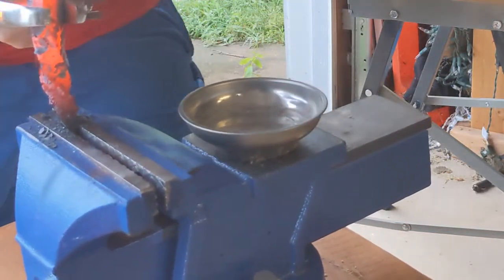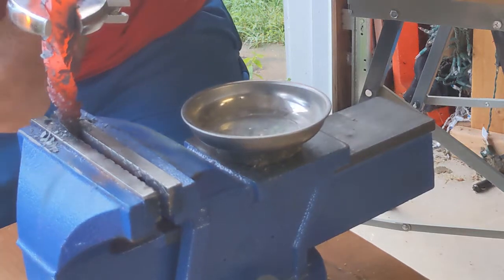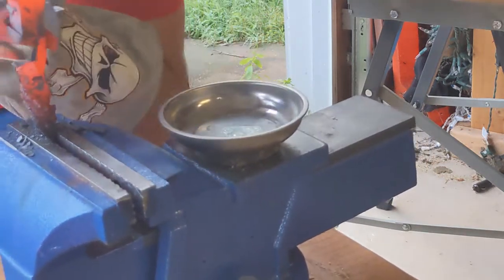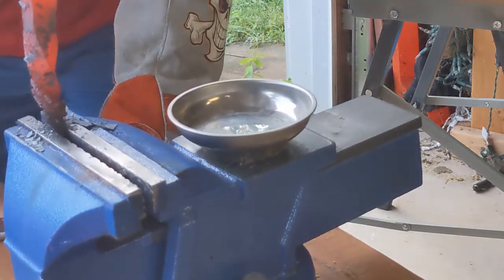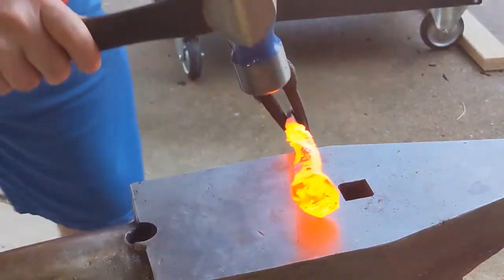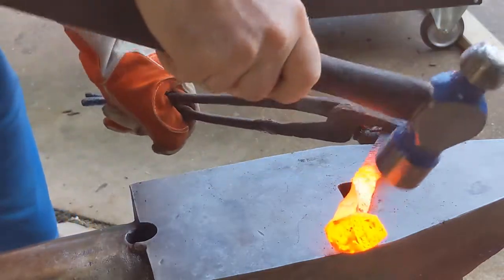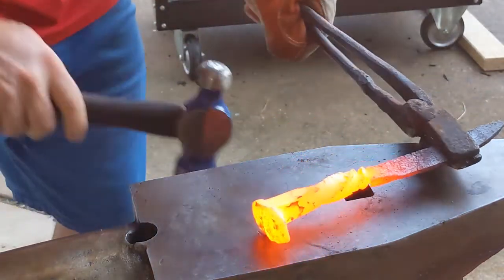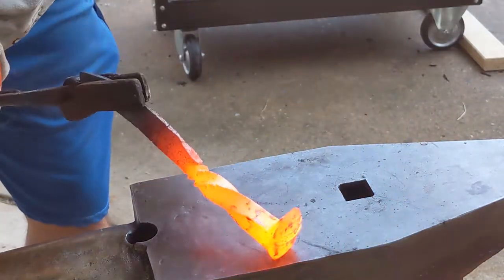Ideally, you should do this steady, smooth, in one motion. But I hopefully will soon weld another piece onto this wrench, so it becomes a much better twisting wrench. But you can see the stress fractures really became apparent here, and in that twist, there's a whole lot of cracks and pivots, and a lot of the energy of that twist, instead of going into a nice clean twist like my first knife, went to a point right between the handle and the blade where it almost failed. It almost completely came apart.